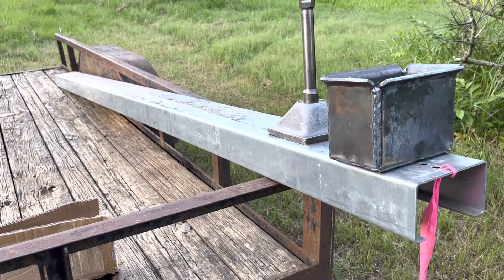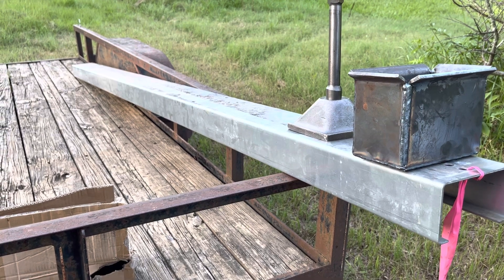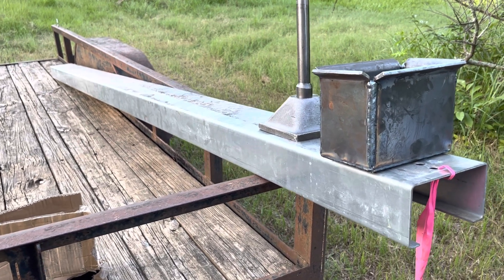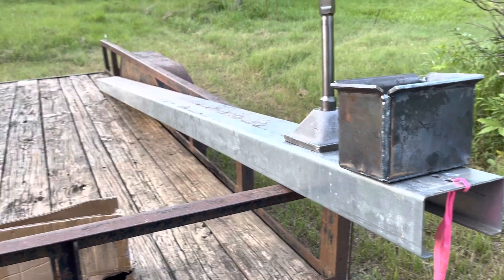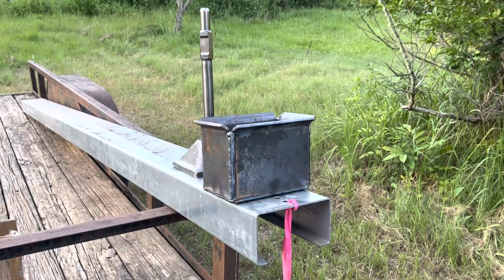Now you can drill them — drill a 24-inch hole about seven feet deep and fill it with concrete, and that will work. I have the equipment that will do that.